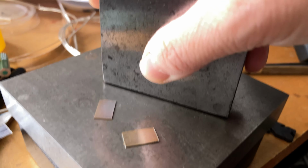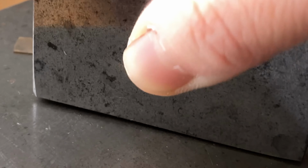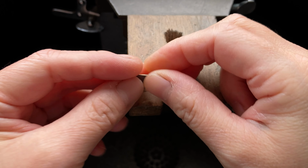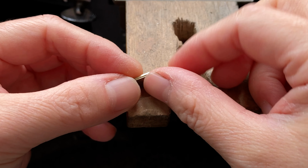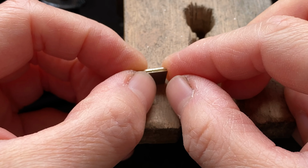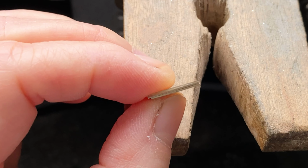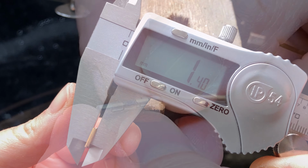and hammer them flat. You can use a planishing press to do it, but I don't have that machine here. I use 2 bench blocks instead. After that, this is how they look when I stack them together. Each of them is more or less the same size, but not exactly yet. That's good enough for now. I will make them all the same later. The total thickness is about 1.4 mm at this stage.